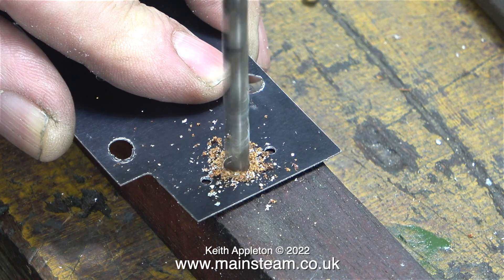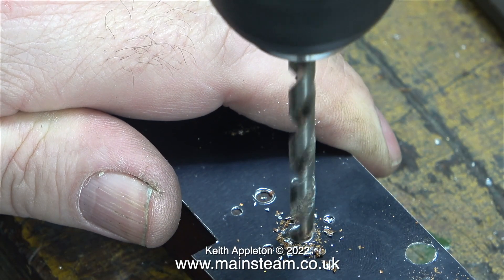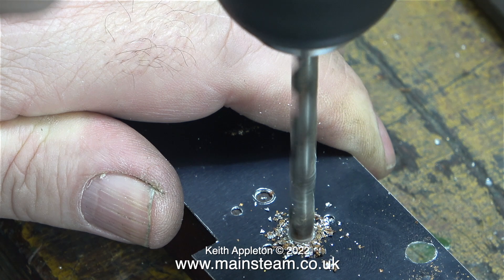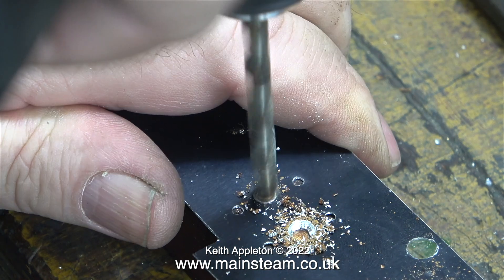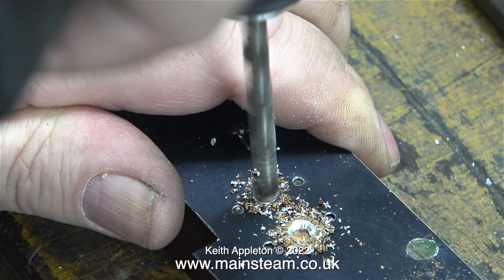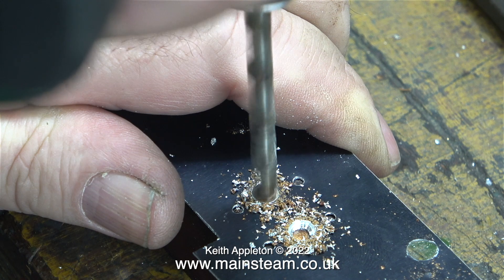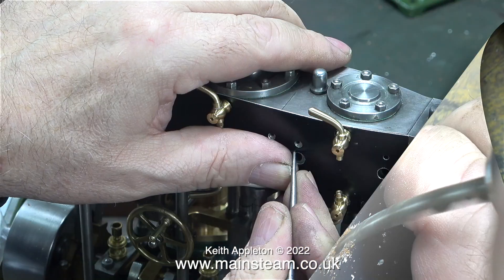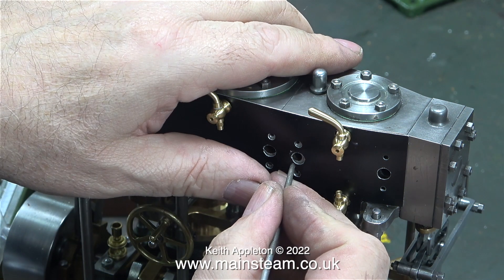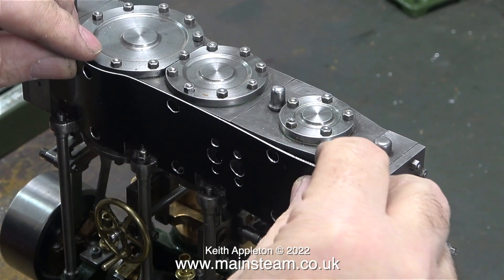Once I've moved the position of the holes to be in the right place, I fitted a drill bit in my small Bosch battery-operated electric drill and drilled out the holes so they were round. I didn't want to use the drilling machine in case the drill bit grabbed the work — and yes, the drill bit could grab in this electric drill, but it stops instantly. This hole, which has to match exactly with the intermediate cylinder steam chest inlet, is not quite in the right place so I'm remarking it.